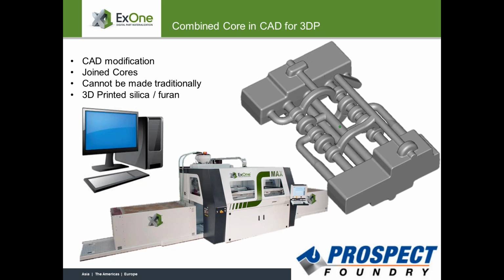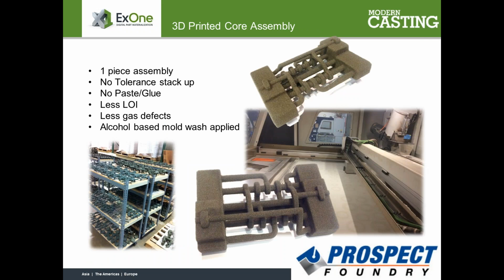You could go on. In this case, it was not only the assembly time, but the LOI and the trapped gas in the mold. So we really got a good double punch of saving time on assembly and improving that LOI so that we reduce the amount of gas created in the mold in the first place. It's a win-win on both situations. So one type of core across the board isn't the answer, it's good to test different things, maybe, is the point of that.